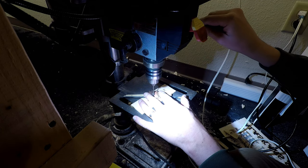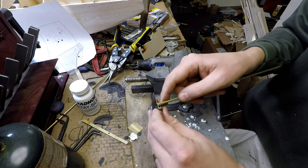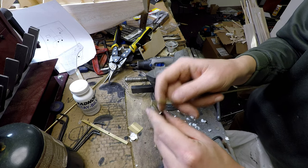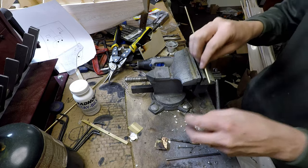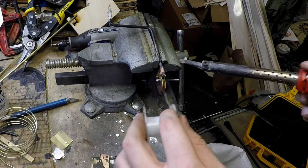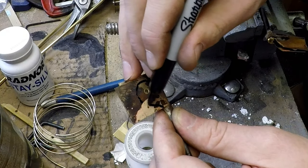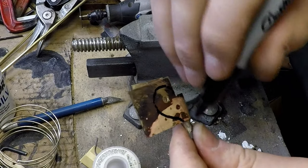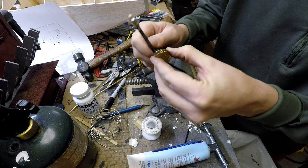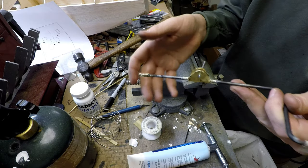Moving to the drill press, I put a sacrificial piece of wood between the inner brass part, then drill a hole centered on the break between the upper and lower support arms, 3/8 inch from the centerline of the steel rods — large enough for the 4-40 screw that will become the hinge pin. I also cut a short piece of brass tube to fit between the holes on the upper arm so the bolt has something to bite into rather than just bending the soft brass. After a lot of fiddling, tweaking, hammering, tapping, and filing — it moves pretty freely.